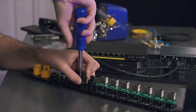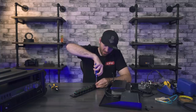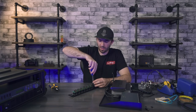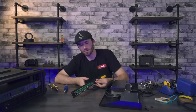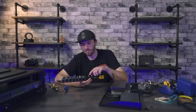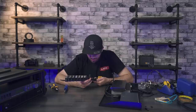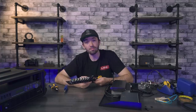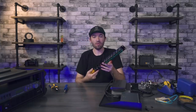And screw it back in. There is one tool, or I guess material, that I'm missing from this build. And I spent like 30 minutes trying to find it in my apartment. It's room temperature vulcanizing silicone. I usually use that on all these type of screw connectors on the backside, just so that they don't get vibrated out. But I couldn't find it, so I'm not going to use it this time. But usually I do. So I'm sorry. Sue me. Unsubscribe.